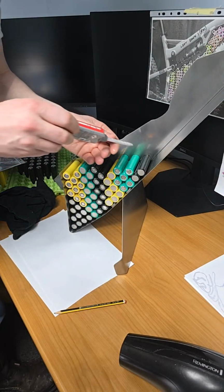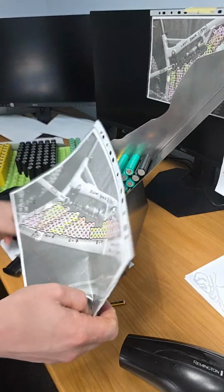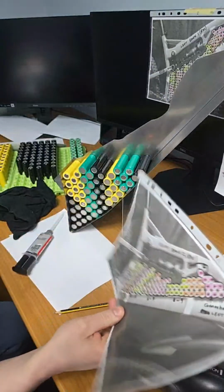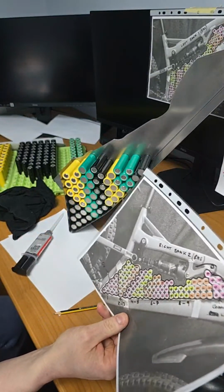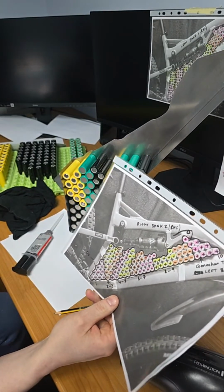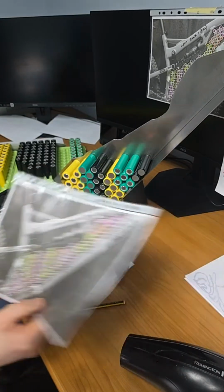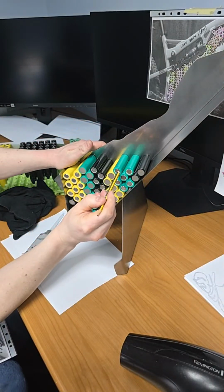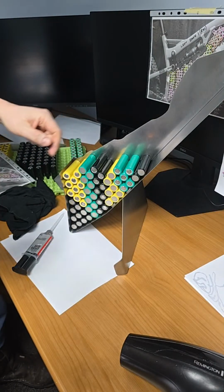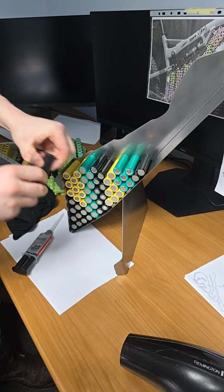The glue I'm using is a high epoxy resin, or sorry, high temperature epoxy type glue. I just want to confirm this before I go any further here. We don't want any mess ups, because this will be a nightmare to get apart again. The film would be destroyed on the cells, by the way, just to point that out. As the glue sets, I'm going to be tapping the cells to the back wall. Why? Well, remember I have to glue the side yet. Why?